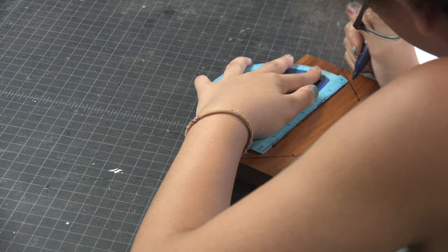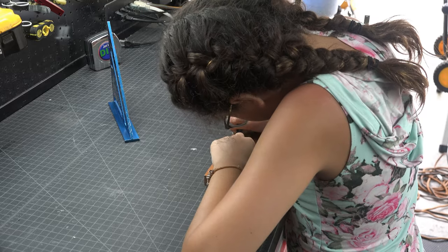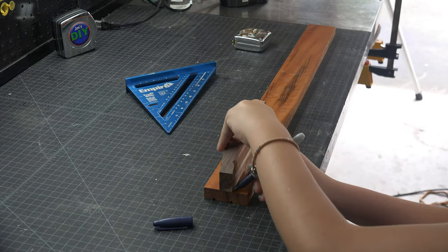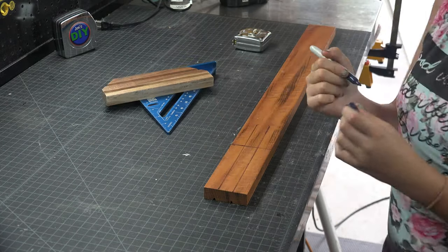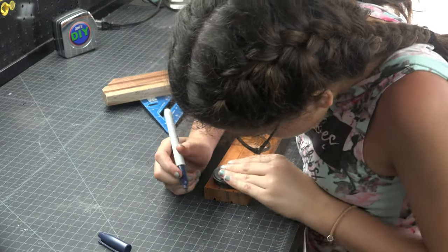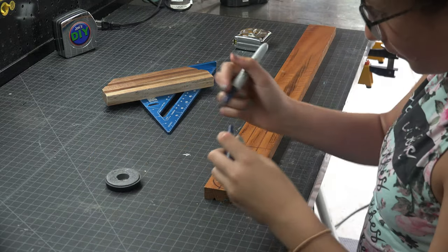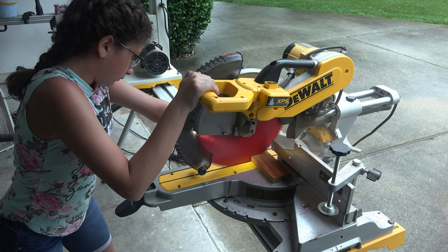For the snitch holder, we will make the display stick out five inches. Take the shelf you just cut and use the width of it to mark down the center of your board. Find something round that is at least a half-inch larger than the circumference of your snitch and draw out a circle on one end. We used a round cup magnet — I can't tell you the exact size, but you can see it will be enough to drill a hole inside it to allow the snitch to sit in. With all your lines drawn, you can cut them out.